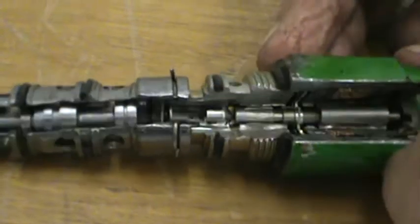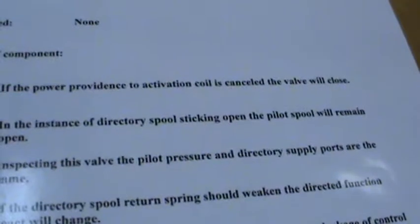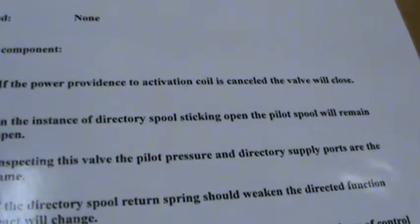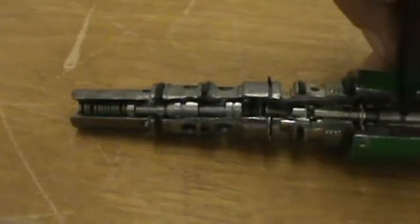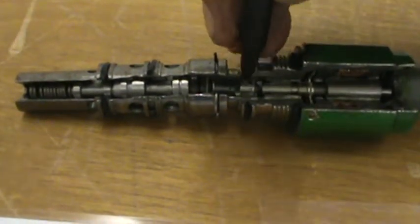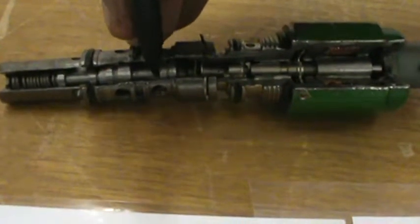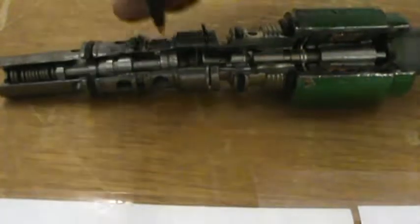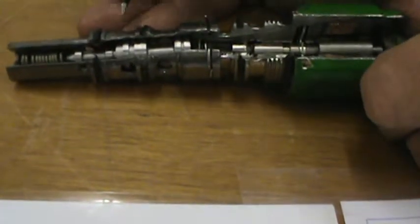First question concerning this: if the power to the activation coil is cancelled, the valve will close. That is correct. You have this spring right here. If you shut the power off, it's going to shut the hydraulic oil which comes through that orifice, and that spring is going to push this valve into the upper position, closing the passageway off.